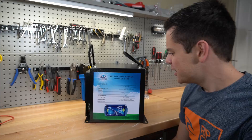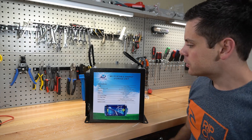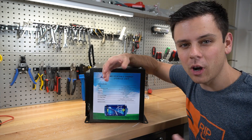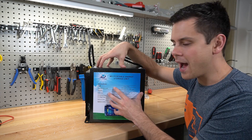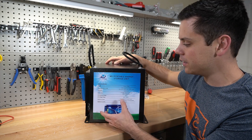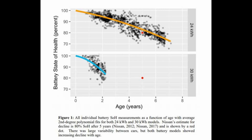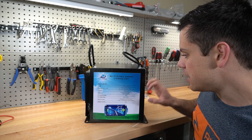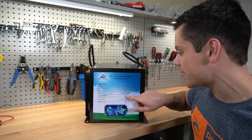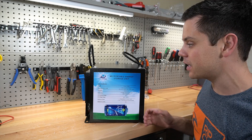Today we're doing a quick review on a Nissan Leaf used cell battery pack from Big Battery. They sent it out for this review. They're putting used cells into a pack with its own BMS and a metal case for solar use. As you may know, the Nissan Leaf had heat management issues, so cell capacity is usually bad — these are only 65% of original capacity. This is a 2.8 kilowatt-hour NMC cobalt-based pack weighing 71 pounds.